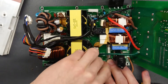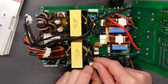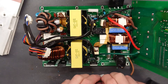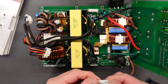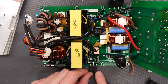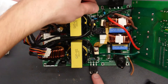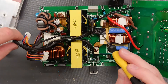That's actually a first for me to see these kinds of completely surrounding sleeves. One broke, so let me read the marking. It's a Fairchild 1A26AZ — that's probably a MOSFET. We have two MOSFETs and they seem to each have their own transformer along with the ultrafast diodes.